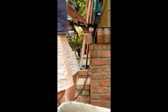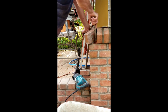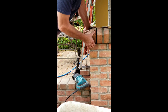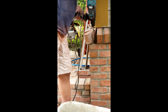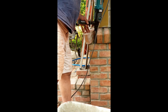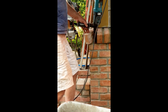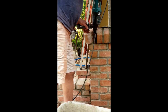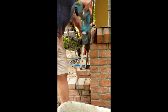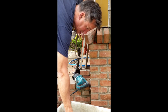Some of these bricks get knocked loose - mortar is not glue. But you might be surprised how much you can reactivate mortar when it's still green. Without taking it apart and redoing everything, you can often reactivate that mortar - just a mason brush with a little water, smack it on there, and work the mortar until it's soft again, and a loose brick can be easily fixed like that one there.